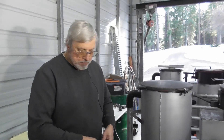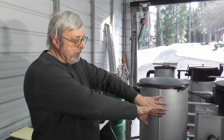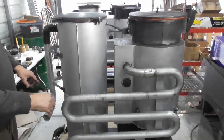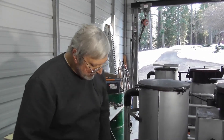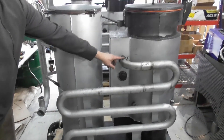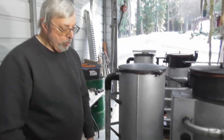Once everything is fit, the tabs are going to be the very last thing that we do. And once we have all the tabs in place, I'm going to take it apart — you can see it's kind of got beat up during final assembly. We'll disassemble the components, touch up all the paint, put everything back together, and then put the final seals on. We've got some black silicone — we'll put our high-temperature silicone on, and then it's pretty well ready to go.